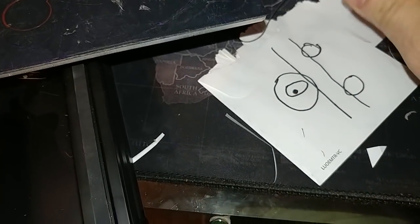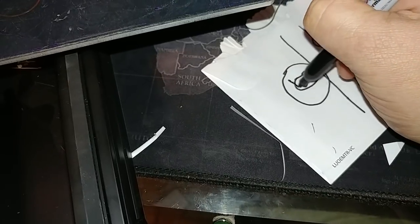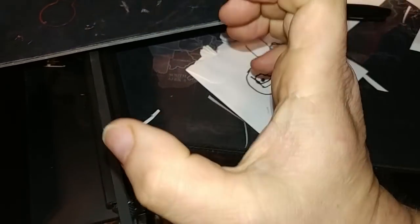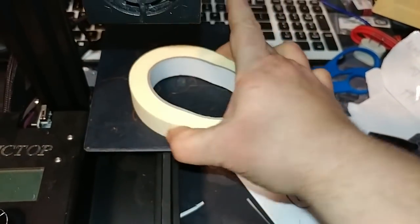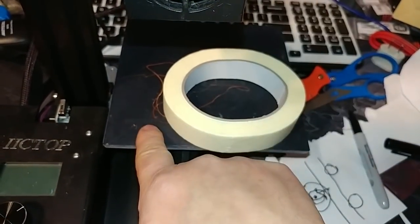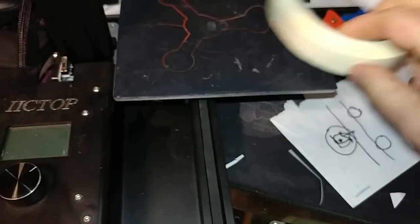Depending on what position you're in, like here, this position would be pushing this wheel as far away from the extrusion as possible, while this end being on this side would bring this wheel as close to the extrusion as possible. So this allows you to shift the position of the wheel. If I turn this, it just turns. But if I make it like this, well, now I'm really close. Now I'm really far. See how it changes where you are? I got more space here now. If I turn it this way, you have less space here. So by turning the nut like this, I am tightening the wheel against the rail, which, because it's a three-point contact, tightens the entire bed.